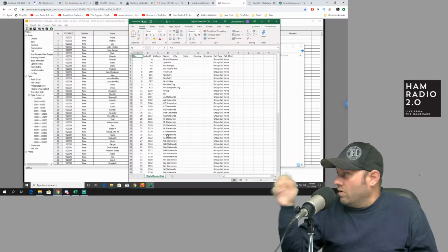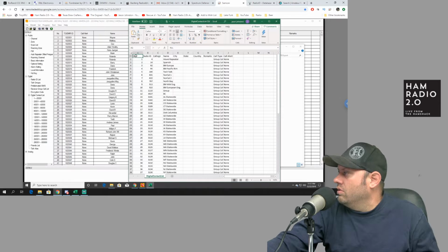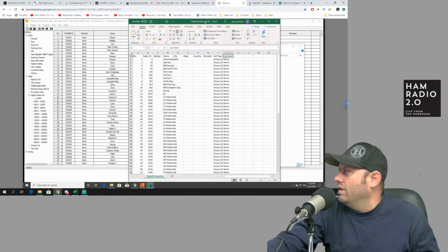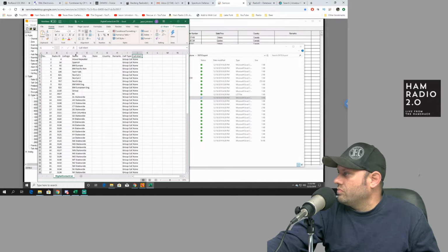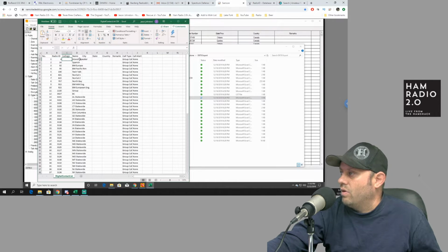So your export is going to look something like this. You're going to have across the top here: number, radio ID, call sign, name, city, state, country, remarks, call type, and call alert. Across the top of that file there, and then of course the number is just a numbering sequence for the radio itself. And then your radio ID is the subscriber ID of the person that's downloaded from radioid.net, call signs, obviously.